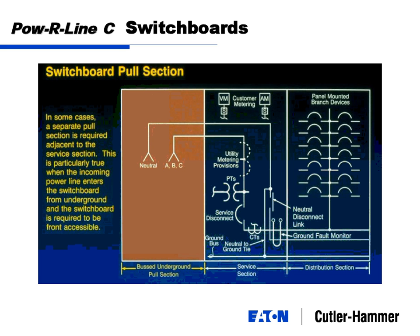Well, that's a lot of bending and stuff. So in that case, very typical to look at a separate dedicated structure just to be able to manhandle all those cables. Now, we don't make cables or do the installations as a manufacturer. I'm not that concerned with how you do it, but I guarantee your contractor will love you if you leave room for a cable pull section like that on a large amperage project.